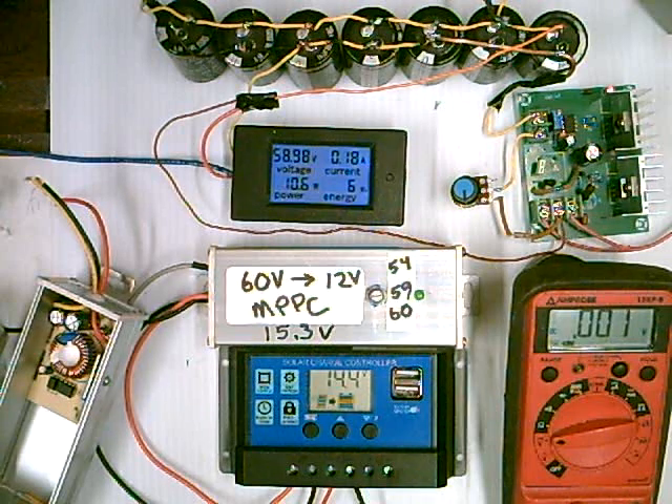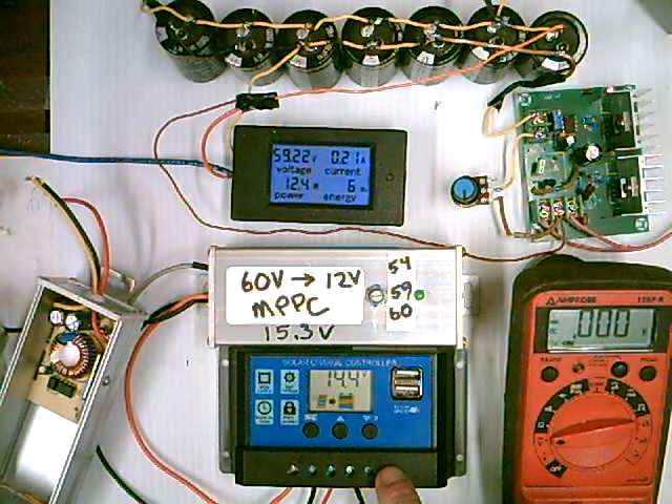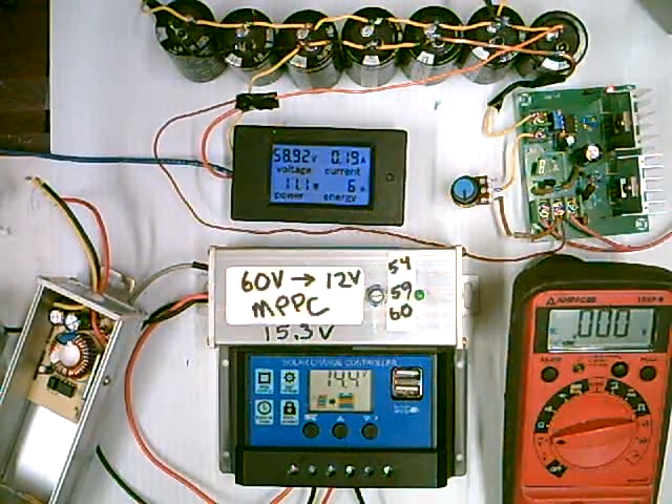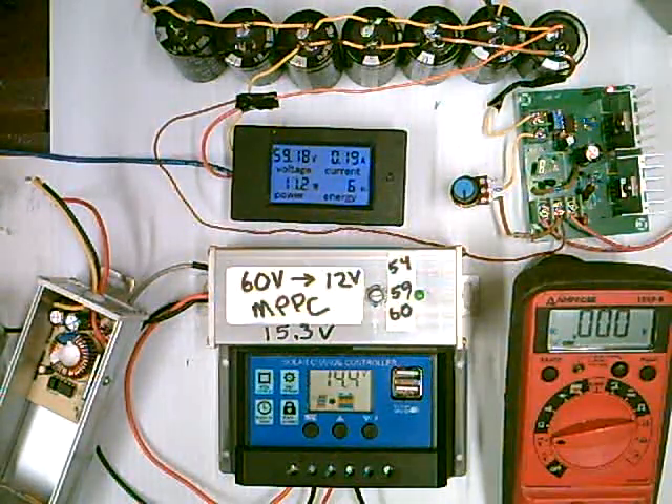The other thing is that you don't really need to use all the power that the panels can produce, because they'll produce a lot of power for two hours, but the rest of the day you don't produce as much. So you actually need a lot more panel to power your electronics throughout the day. What I have here is a cheap PWM charge controller — I think this one cost me $3.50 from eBay, shipped from the United States, but you can get these for $5. And this is a 72 down to 12-volt buck converter.